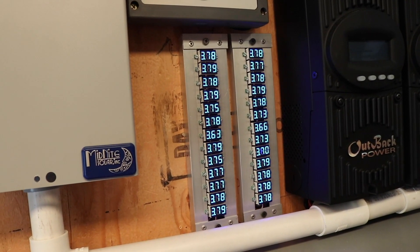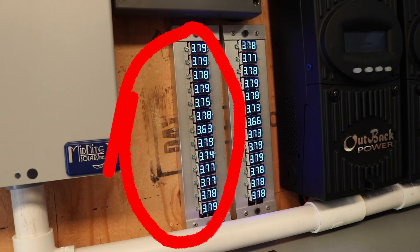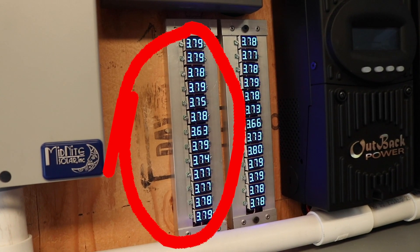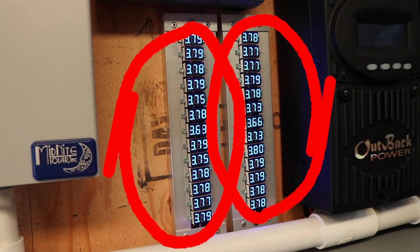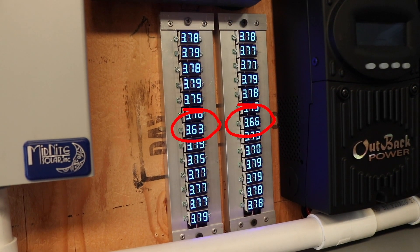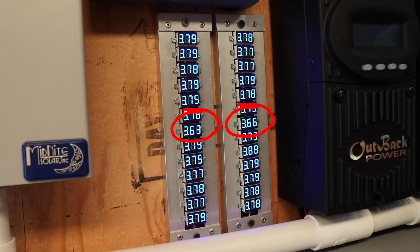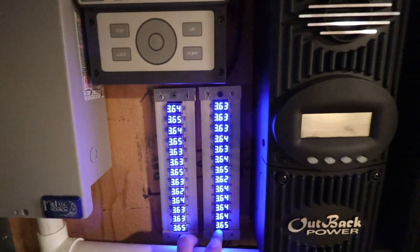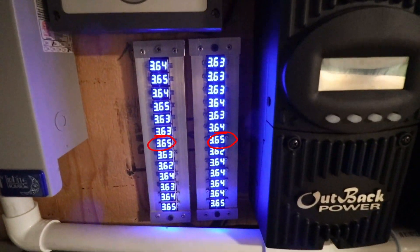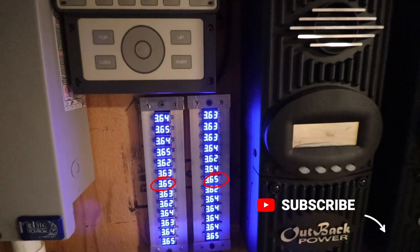The battery's BMS is an analog system used to monitor the cells within their series. Each individual volt display shows the cell's voltage at the start of a string, and its adjacent display is used to see if the battery cells are self-balancing. As you can see, the seventh string of cells is lower than all the other cell series. So along with pack cycling, we manually applied charge to that string to bring the voltage up to meet all the other strings of cells, which you can see here in this video.